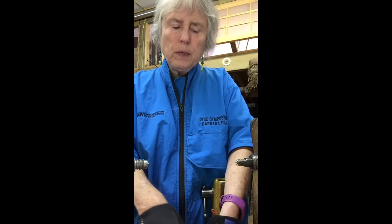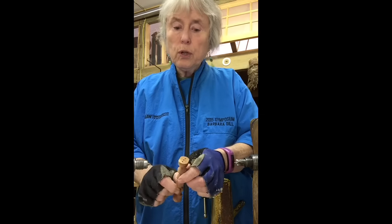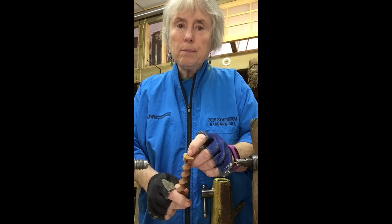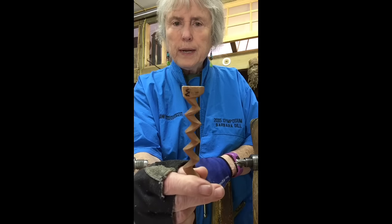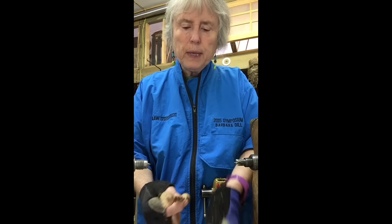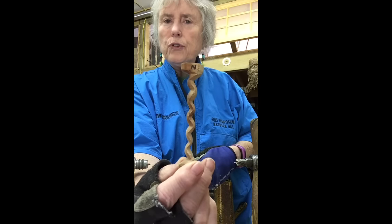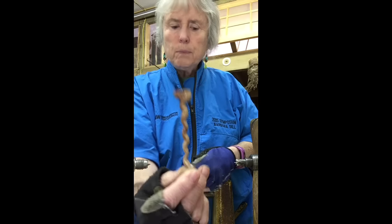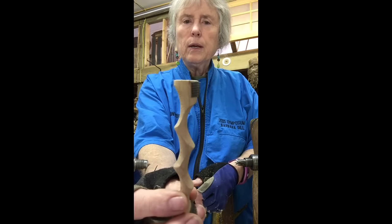Now, most of these spindles are turned just like the one I just turned. They're parallel axes in the same plane with the center axis. Here's one that I did, which is alternating V cuts. These were all done when I was experimenting in 2006. This one, which will become significant in the last year, these are alternating beads on two parallel axes. These are alternating coves.